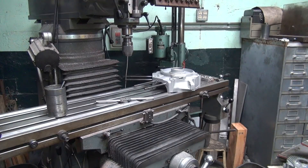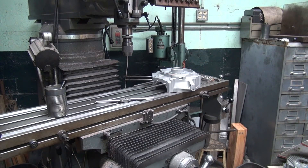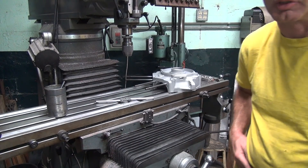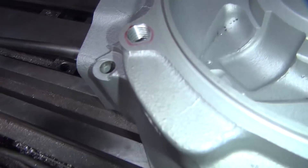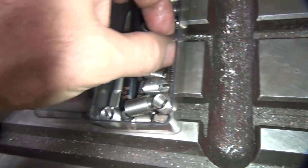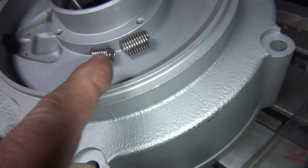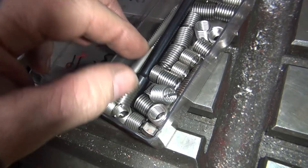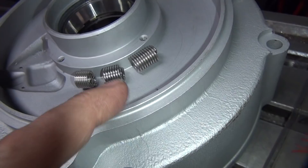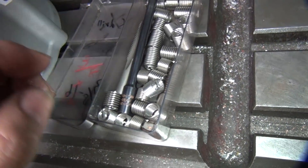I think it needs a longer helicoil now. Now you get to guess how deep a helicoil you can put in a hole. Here it'll be pretty deep. So we have the normal one and we have the longer one — see the difference? That's probably one diameter, or a little bit over one. That's probably one and a half diameters. The diameter is the diameter length of the bolt. There's a little stubby one — that's probably one diameter. And then you get the two-diameter ones, they're really long. And you've got 2.5 diameter and 3 diameter — those are your normal dimensions.